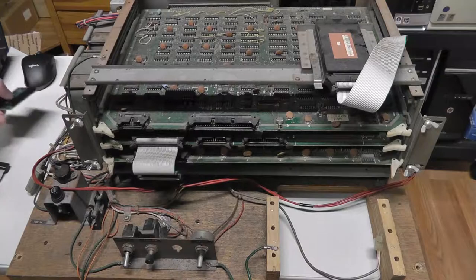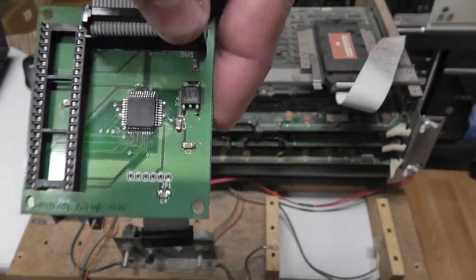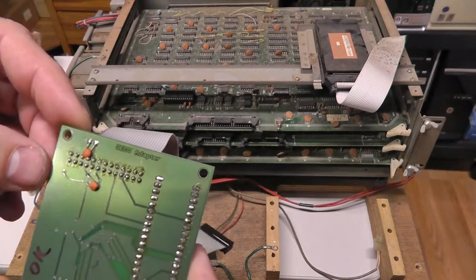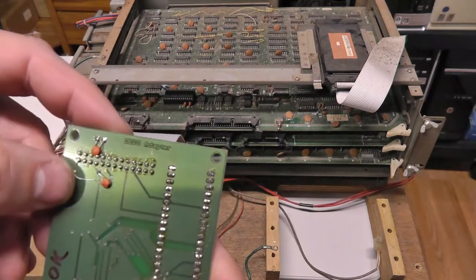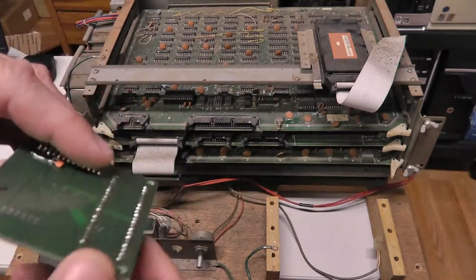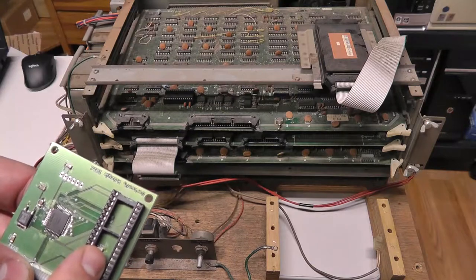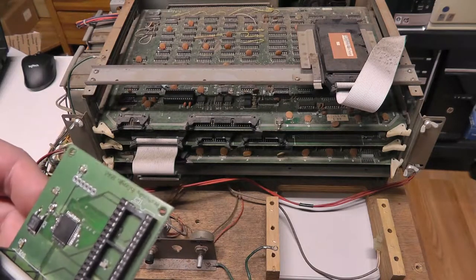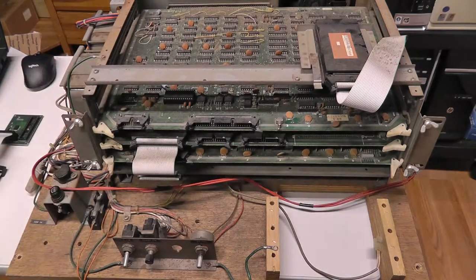While waiting for parts from Amazon, I figured I'd use the Darksoft multi-kit and see if we can get anywhere. This is one of the earlier ones. I spent some time reading up on it — they've updated the software and there are a couple of capacitors added to the bottom. I'm busy erasing a 27C800, which I think is a one-megabyte ROM, and burning some other chips.